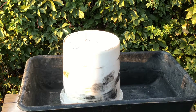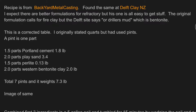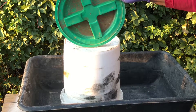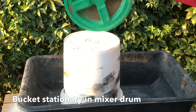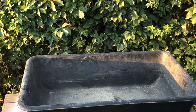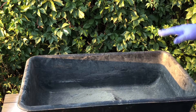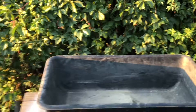I've mixed up a batch of Refract-3 according to the recipe on Backyard Metal Casting and put everything but the clay into the five gallon drum here. I rolled it in the Harbor Freight cement mixer with a seat cushion. The main goal today is to find out what a measured amount of the ingredients will produce in terms of a final result. We're supposed to mix the water into this mixture without the clay.